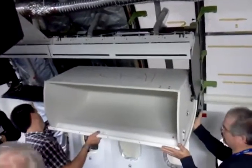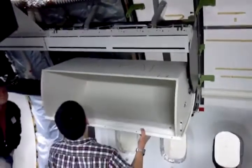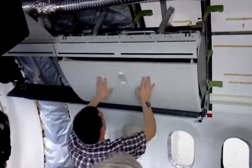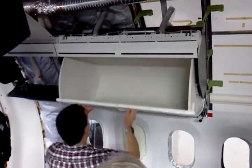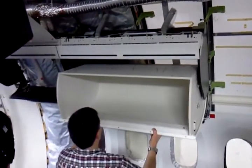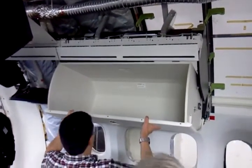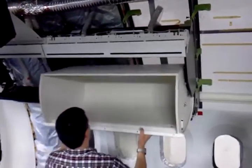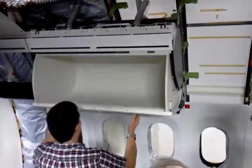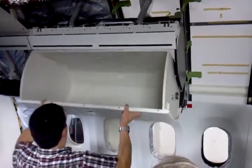This is key. Once you get this underneath, behind there, go ahead and let go. You just lift this up. You drop it down until it lines up with that piece and it drops out, which is right there. It comes out and then it rotates out like this. That's the trick — the key motion is up, in, close. So once you close it, you come down. That's where it disengages and it allows it to slide out. You get it past that and you rotate it out.